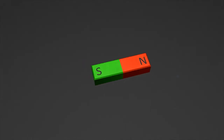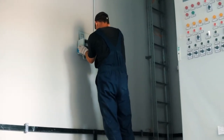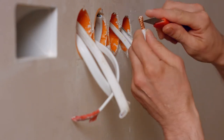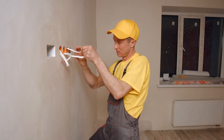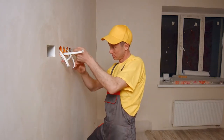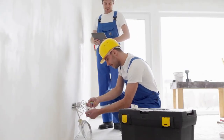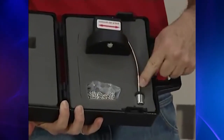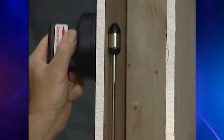The last electrician hack for everyday people is to carry a strong magnet. It's likely that your entire house wiring base requires you to work behind the walls and ceilings. You're always running new wires, tracing old wires, working from small holes in the drywall, and trying to perfectly line up everything from both sides. While there are tons of tricks for drawing lines and punching small holes to mark your way, there's really only one main useful trick that doesn't require permanent changes at all — magnets. They can detect ferrous metal components and are easily detected through lightweight building materials such as drywall, wood, tile, etc.